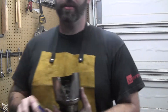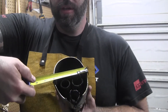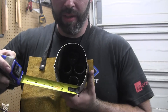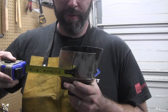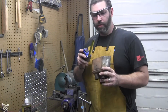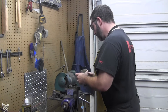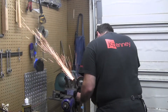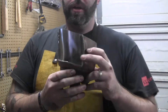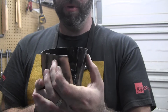When I decided to make the pie cut, I measured it — it's four inches across, so I took two inches each side right there. I'm gonna cut this free and try to bring them in. Since I'm going to use two-inch exhaust pipe, the closer I can get this now the easier it'll be. I'm gonna cut down the side, pie cut right here, and work on trying to bring these in.